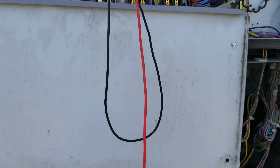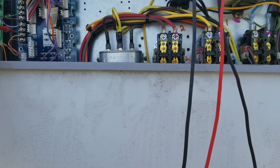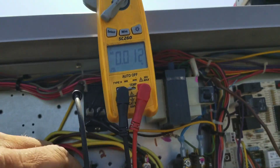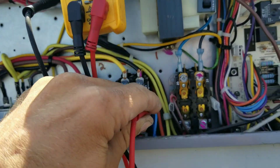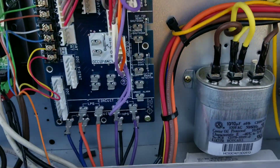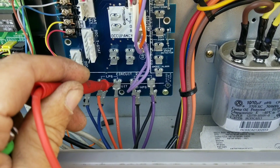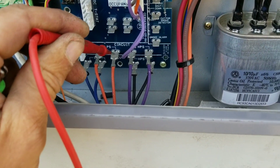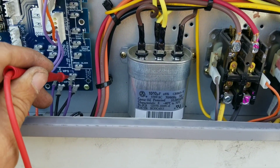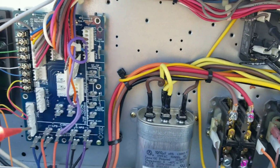We've been running for about five to ten minutes now and I still don't have any compressor action. I verified I still have a Y1 signal, but I have nothing going to any of my contactors — that's my indoor blower contactor right there. So we'll check our safety circuit, logic circuit, pressure circuit — whatever you want to call it. The right side is our incoming power going into the board from the economizer. I have nothing on stage one, nothing on stage two — no voltage going into my logic circuit.